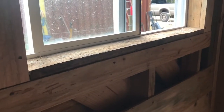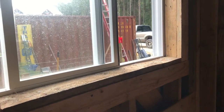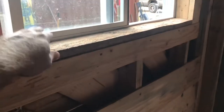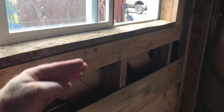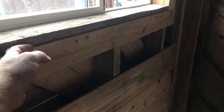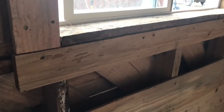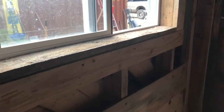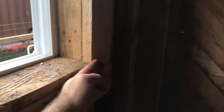That'll be my first go at a sort of farmhouse trim window frame - hopefully nobody bashes me for doing it wrong because I was winging it. My wife said she wanted the window sill to stick out so she could set a drink or some tools up there, which makes sense. I used a 1-by so it sticks out about an inch. The trim underneath is seven-eighths, as is the other piece, so it pretty well flushes up. It does add an inch to what was the window sill, and it doesn't protrude beyond the main window frame.